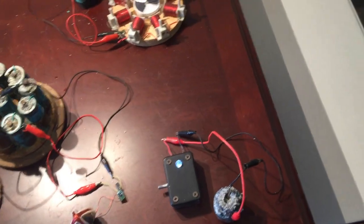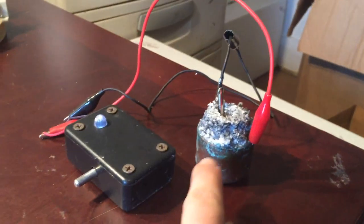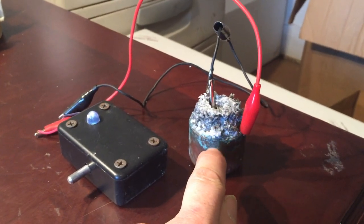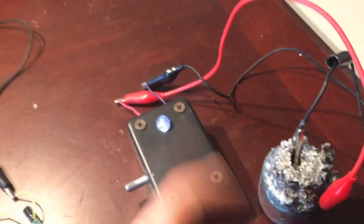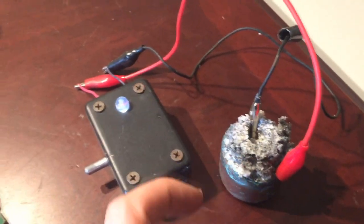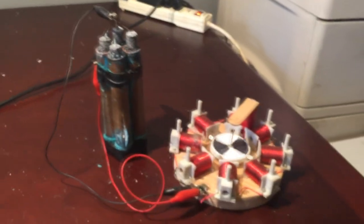Even if you subtract a month, it's still a very impressive runtime. During that time, the internal pressure pushed the magnesium rod right up out of the top of the pipe cap. Very interesting how much pressure builds up, and I think that's a key to what makes these things keep running year after year.